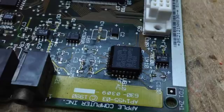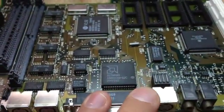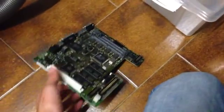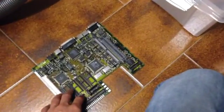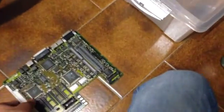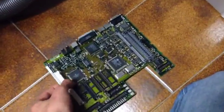That's just disgusting, so I'm going to go ahead and wash it. My method is to soak the board in some water. Previously I did it using normal tap water, and that left some white residue - which are minerals - onto the board, so then I had to clean with some IPA.